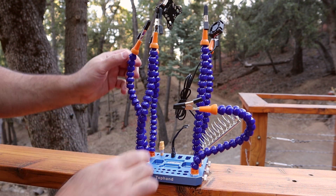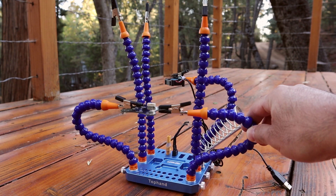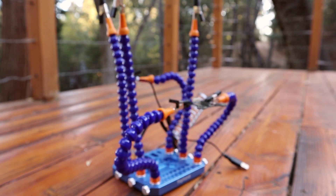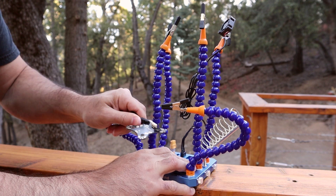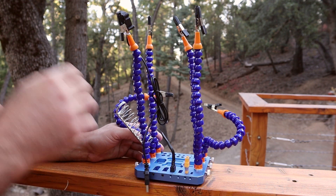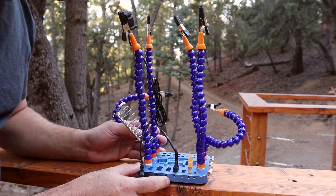Really, it is a useful tool to have around the bench when you are building quads — very useful not only for soldering but also for conformal coating parts. You basically just put your part on one of the arms, brush on the conformal coating, and then let it dry off to the side while you work on something else. Now that I have this one and also the original, I'll most likely use one to dry conformal coated parts while I use the other one to solder.